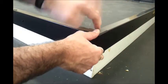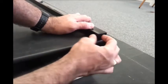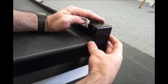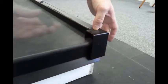We'll repeat the procedure for the edge where the curb edge detail meets the front drip edge, and then we'll use a large end cap to plug up the hole for this side of the corner.